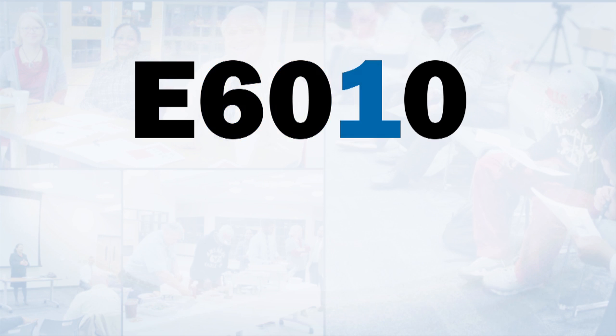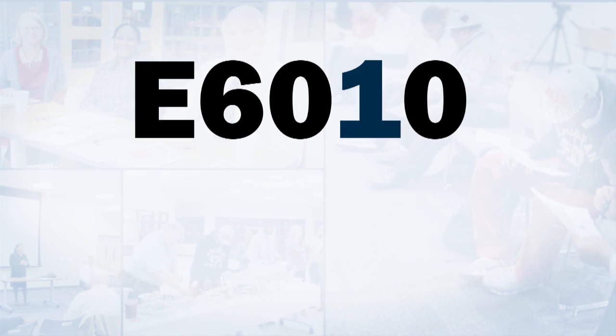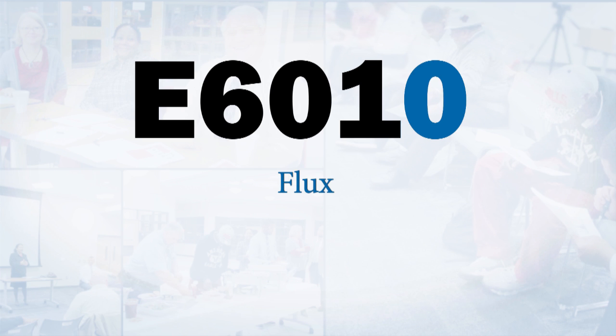The 1 is the position. 1 is all position. 2 is flat grooves and fillets, or horizontal fillets only. And then there's a 4, which is specially made for welding vertical down. Our last digit here, the 0, tells us what's in the flux. In this case, it's a fast freeze rod. It uses a particular type of coating, and it's designed to dig deep and freeze quickly so that you can get into that thicker material.